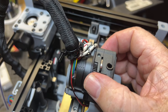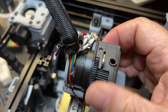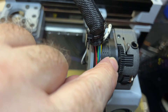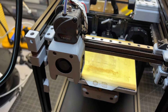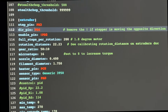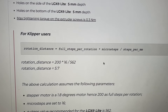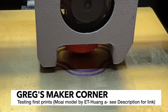Before you start looming, make sure all your wires are good and you don't have any loops or kinks. Make sure the assembly is moving nice and smooth — if there's any roughness or slowness at all, you've probably got an issue. One thing to check if you run into problems: there's a little pinion that fits into the 3D printed part, and you may need to clean out that hole a little. Everything powered up fine, fans are still working, preheated the PLA. However, when I tried to load filament it was going backwards, so I needed to reverse the extruder motor direction. You'll need to change your direction by removing the exclamation point in your config if things are reversed. You're also going to have to set the rotation distance — it's significantly less at 5.7 than what the mini afterburner uses — so make sure you change that. Those were really the main changes I had to make in Klipper.